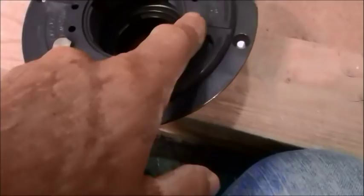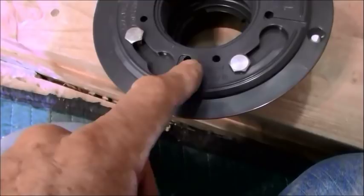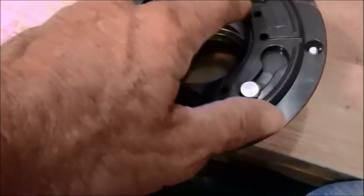There's no way you clog a weep hole with sand. There's no way. Look at the beach. Go to the beach sometime. The only difference is that at the beach, you don't have any cement. But the cement is still porous, just like the sand is, and water is going to get through here very, very easily. Water will get through all of these areas very easily with a sand topping mix involved.